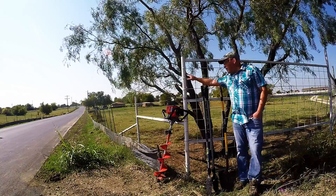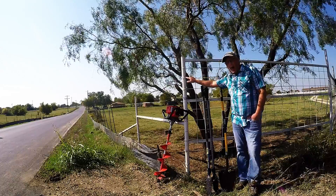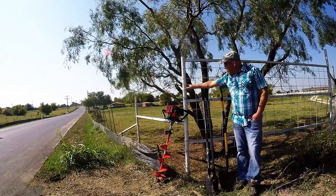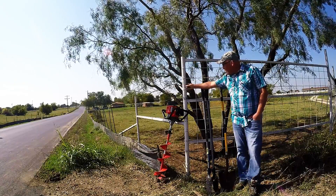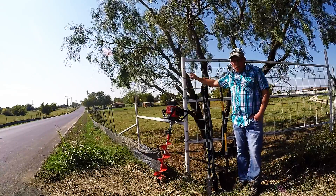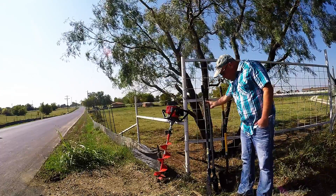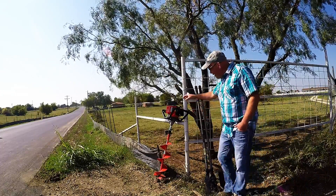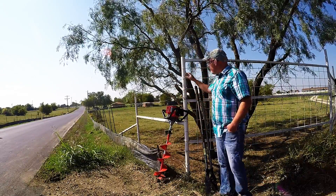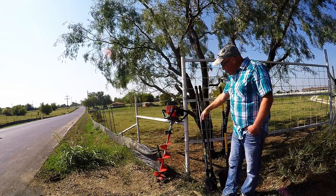Now the most important part of the barbed wire fence is this corner post, and it's true on any corner of any field that you're putting barbed wire around. This post has to not move. They say that each of these strands of barbed wire can have up to a thousand pounds — half a ton — of force on this post itself. That's why you dig these holes in deep. Using either your post hole digger or, preferably, a powered auger, you're going to go down about three feet. This is actually a really long post — you're only seeing a little more than half of it right here. You're going to drop that in there.